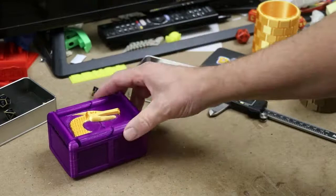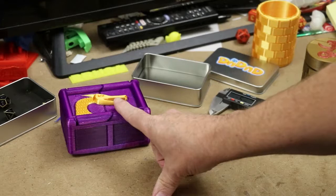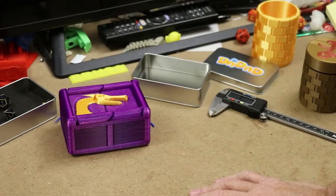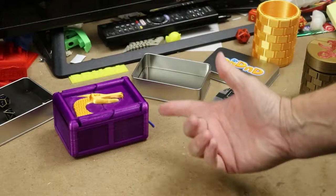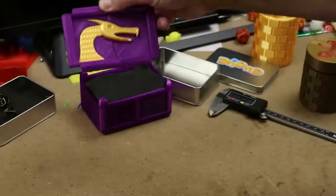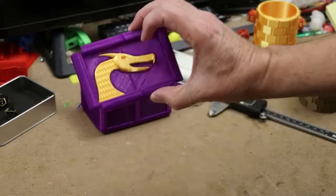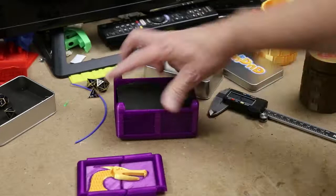I haven't taken the same color PLA to make the hinges yet because I want to show you disassembled, but I'm really happy with the results. This was printed with a CR-10 with a 0.4 millimeter nozzle. Nothing special — 20% infill and a 0.2 layer height. Nothing special about this at all. If you have a CR-10 dialed in, there's no stringing and the layers look amazing. The only thing I did do was I did 10 top layers, because I've done tops before where it would leave holes in it, so 10 tops gives it a really great finish.